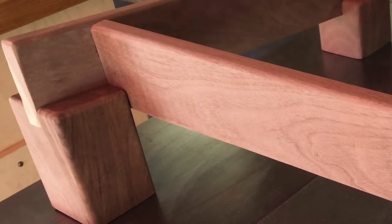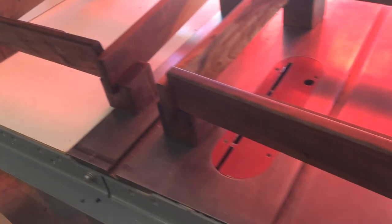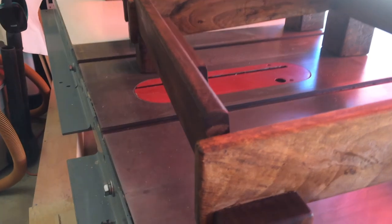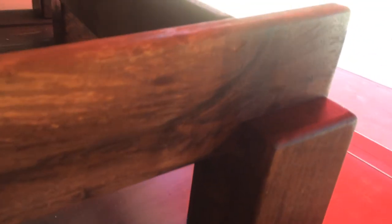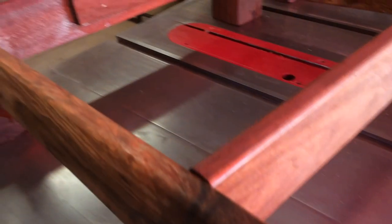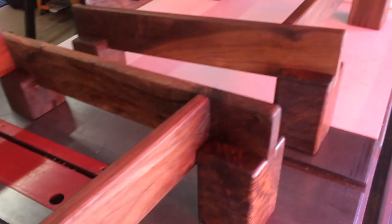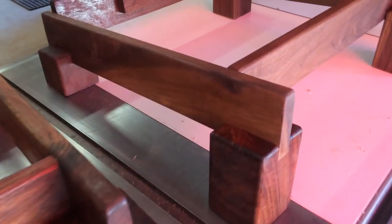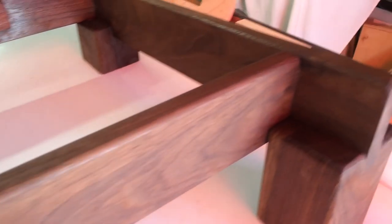We cut them so that they're perpendicular to the ground. Looking at the back side of our speaker stands here — you can notice the posts are a little bit taller than the rails. So when the speaker sits on there, if it were to slide backward, it would catch on that rail — that's how we keep the speaker in place. The speakers were meant to ride on top of these rails. Our guy eventually put a board across that; it just made him feel better rather than have them essentially float up there, although they weren't going to float. The speakers are plenty heavy. You can see how we set them in at that five-degree angle that he likes, and it worked out really well.